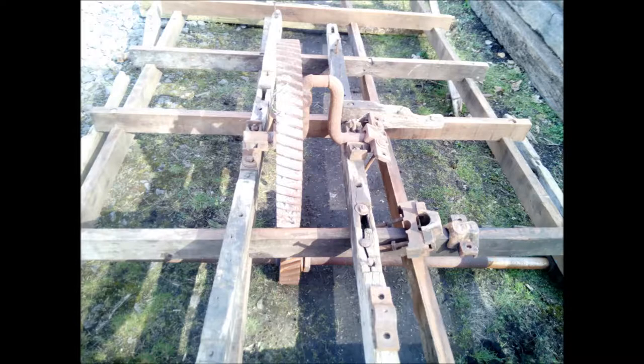Another problem is that the crown wheel is actually fouling on the two cross pieces at either side. And so a quick check on the plan and a count up of the cross pieces, I noticed that there were 6 cross pieces on the new chassis, whereas on the plan there are only 5. So again, this is something that will have to be rectified.